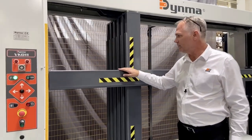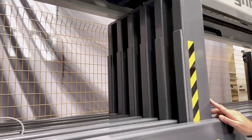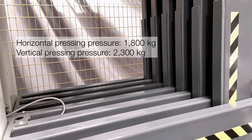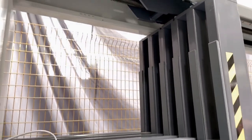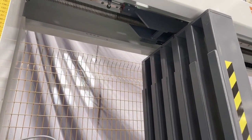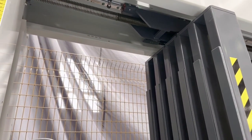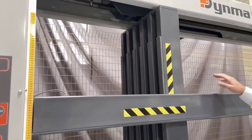With a high number of pressing columns — seven from above and six from the side — that allow full pressure on the carcass with a force of up to 2,300 kilograms, the columns are adjusted accurately by a linear ball screw with a speed of up to 29 millimeters per second. In addition, the basic design offers a high degree of stiffness and stability to achieve the highest quality of finished work pieces.